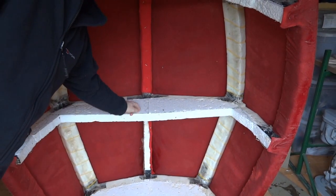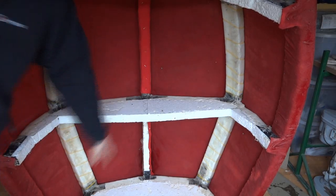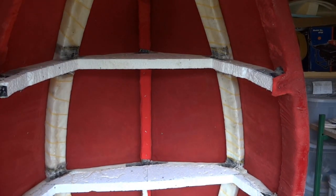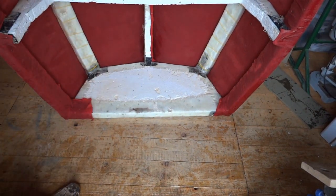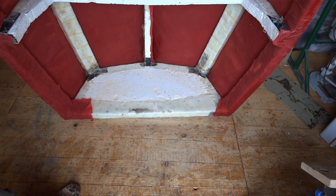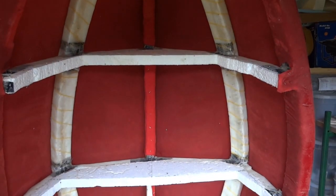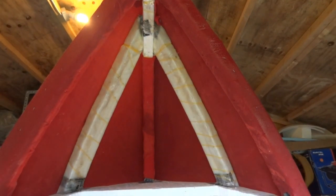These are still bare polystyrene, so that'll obviously be a bit of a seat where I can sit in, and I'll be covering that — probably putting some soft foam over the two beams across the middle so that it's nice to sit on — and I still need to cover the very back as well. It's got woven rovings on the outside and nothing on the inside, so I'll just be covering that with a bit of fiberglass and a bit more fleece. I've got another 15kg of resin on order, which I hopefully won't need. I think the boat weighs in excess of 20kg, probably 25kg at the moment, and with the reinforcement that's going to go up to 30, but I think that's reasonable for a boat of this size. Onward and upward with reinforcing the inside.